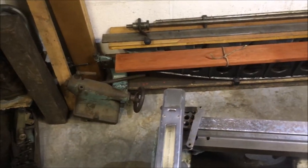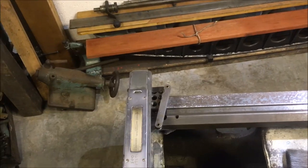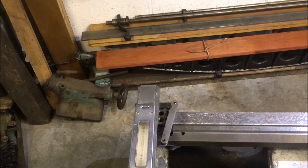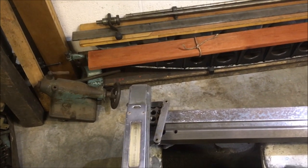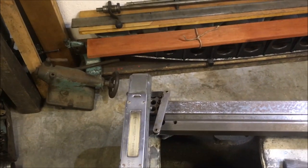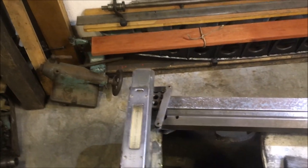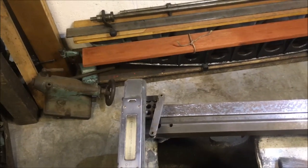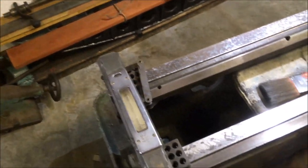When we were digging the foundations for this place, I was originally going to put quite a big void underneath it for storage. And we were digging down the side of these foundations, and we got down to the full depth that the bucket could reach to on the mini digger, which was, I think, 8 feet. And we still hadn't reached the bottom of this brick foundation. So we decided to change the plan and basically backfilled everything with hardcore and rubble, brought it back up, and then cast a concrete base over the top.